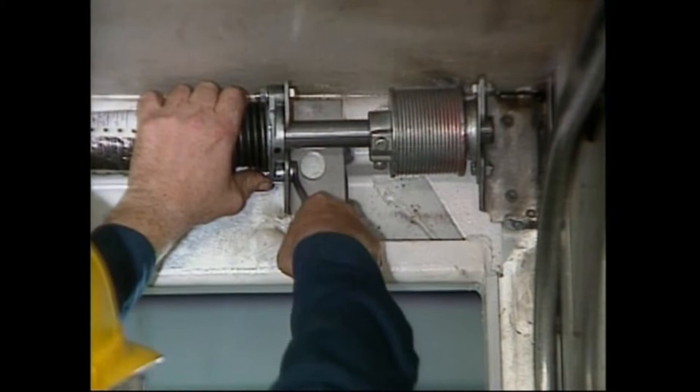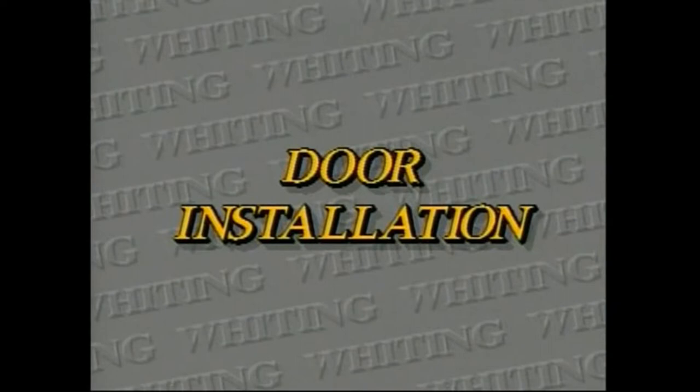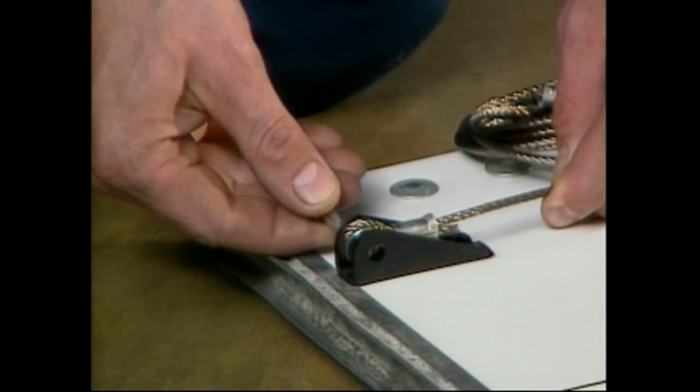The balancer brackets and spring assembly are now installed, and you're ready for installation of the Whiting door. Install the door cables to the door by placing the eye end of the cable through the cable anchor bracket. The cut end of the cable should be adjacent to the face of the door. Secure the cables using the clevis and cotter pins.